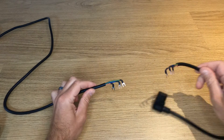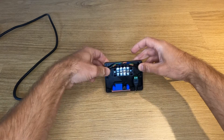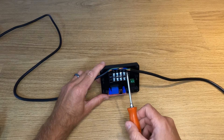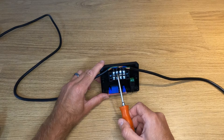Terminate the ends of all wires with spade terminals — I use crimp terminals, which is the safest and most secure electrical connection when using this kind of terminal block. From right to left: the first connection is for both earth wires, the next is for both neutral wires, the next is for only one of the live wires, and the last for the other live wire.